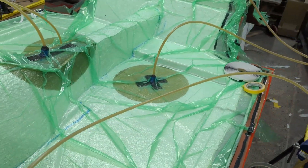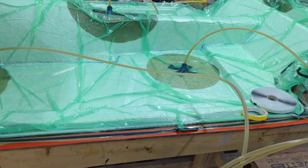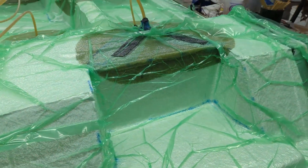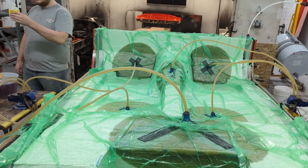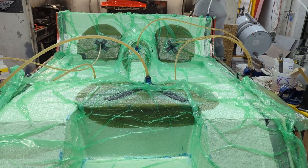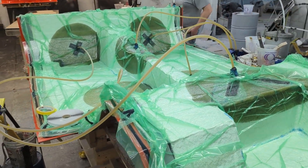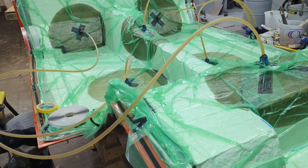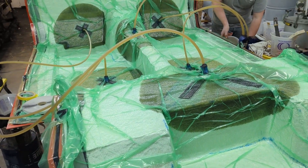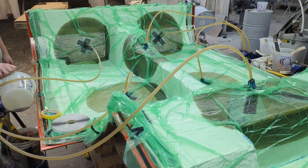It's literally being pulled through here. A big part of it is it's 25% stronger than a hand-laid part and it's 25% lighter. Our ratio is more of a one-to-one ratio between our resin and the composite materials we have inside of this mold. It's a nice size mold, not quite as big as our body mold.